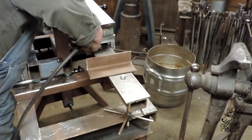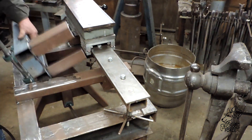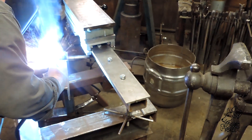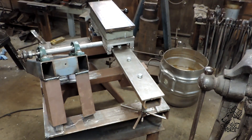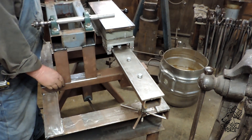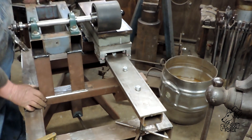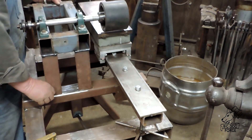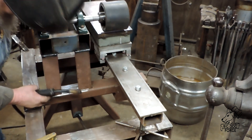These are going to be our stands to get that thing up in the air. Rather than stand it up straight, I wanted it laying horizontal and up high enough to get that wheel over the top, because we've got some more equipment to mount to the back side of this thing. I get this sort of stood up where we think we might need it, and we'll get it tacked into place. I want to get our wheel about center of that magnet — I've got a four inch wide wheel and a six inch wide magnet.